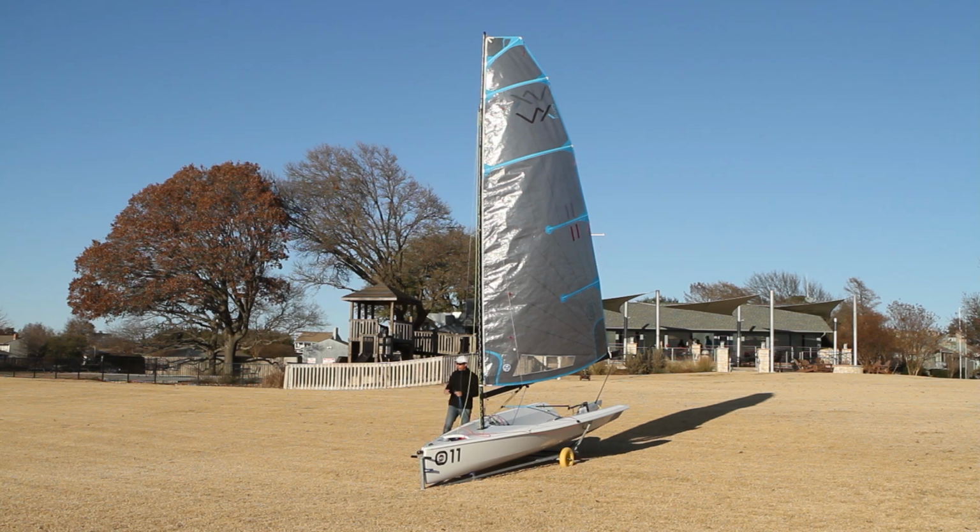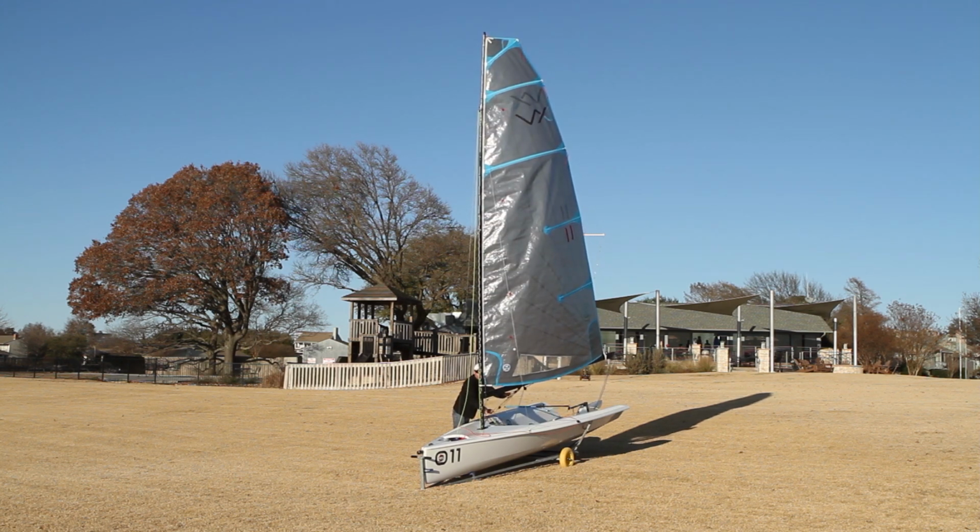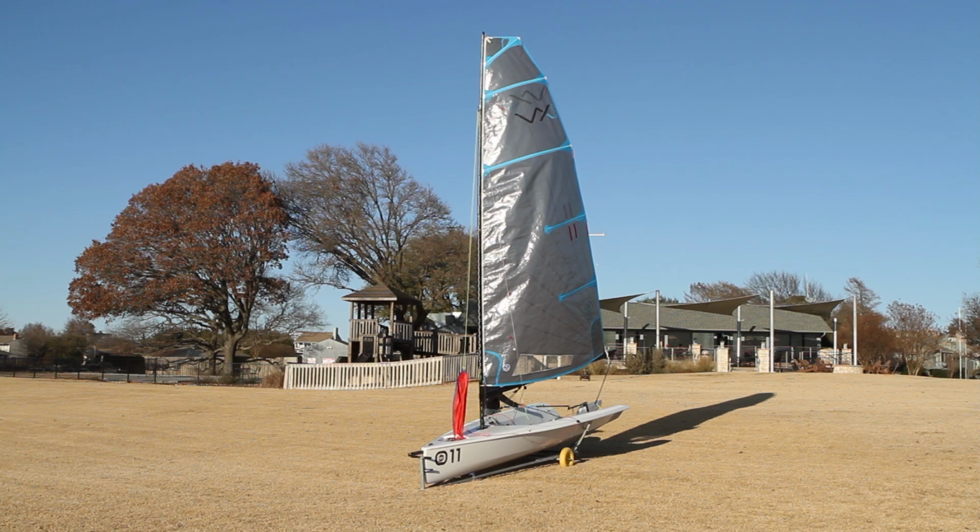At this point right now it's blowing from the north. We're going to give it a shot and hoist on almost a tight reach. So we go again. I cleat the main. Once it's off, I make sure that the vang is completely out, almost to my mark. And the way you know your outhaul is out is you can see the blue stopper ball coming to the block right here. So here we go. At the count of 3, we make sure that the sheets are uncleated. My main sheet is in the place where it has to be, and I can hoist in 3, 2, 1, and here we go.